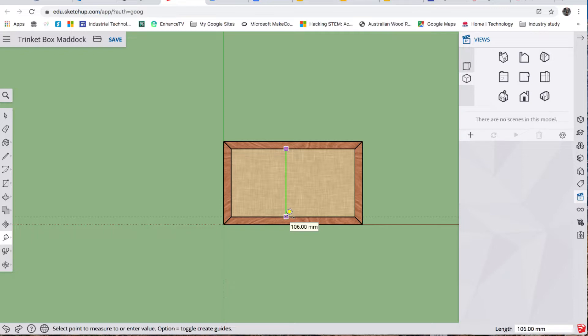You'll need to do this in the real world because the size of your box might vary a little bit. What you need to do is get that measurement and then take two millimeters off it, just so there's a little bit of space so the sliding tray does not get jammed. So I've got 106 millimeters, and I'm going to draw the end of my sliding tray out here.